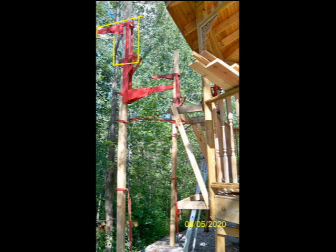The workbench brace attaches to the pump jack and supports a work surface to place your tools and materials. Each set of pump jacks uses 2 braces that hold the 2 14-foot 2x4s vertical. Here, the bottom brace isn't installed yet.